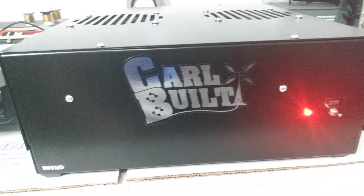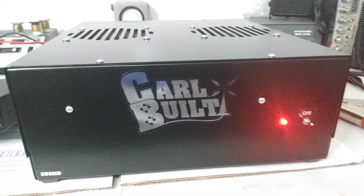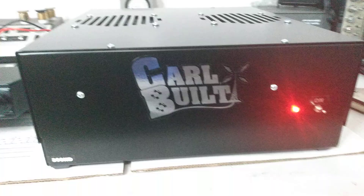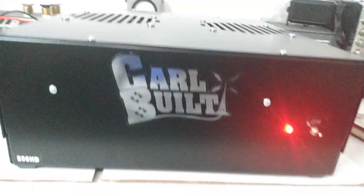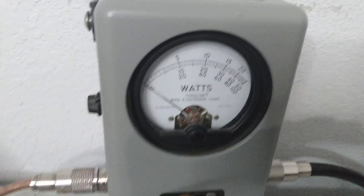So you start driving it harder than that — you put 200 watts in, 250 watts in — you'll see it draw probably somewhere between 125 and 150 amps, but we're just kind of cruising it right now. A 2,500 watt slug is what we've got in. We're looking at average power.